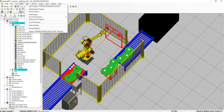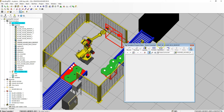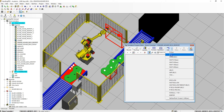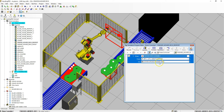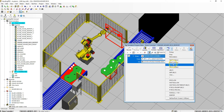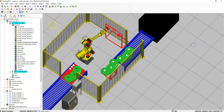Then we need to drop it off. Go to Teach, Add Simulation Program, paste — and this is going to be drop-off. Hit OK. We are going to drop the finished deck onto the conveyor with the suction. Those all match because we have everything set up from the previous video. Half second. There we go — now we have all our simulations.